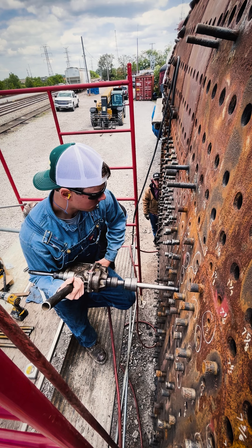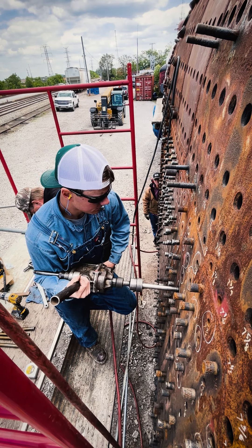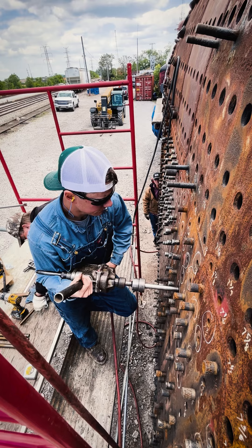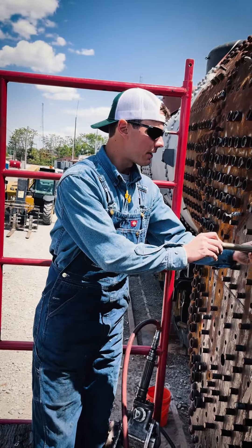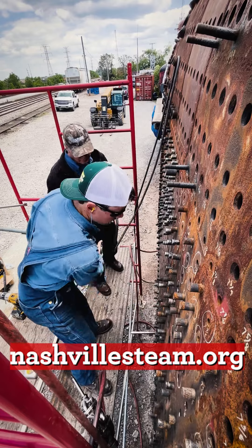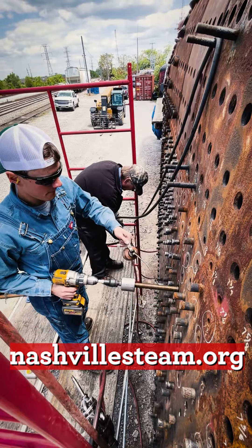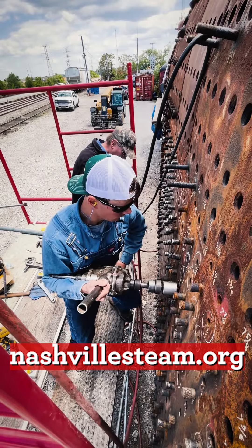The tap will be passed all the way through, then passed back out the bottom. We will clean and inspect the hole, and then we will be ready to install our radial stay bolt — it just threads in like a normal bolt. We will then take an air hammer and drive over the outside and the inside, swelling the bolt inside of the hole and permanently affixing it to the boiler, bedding it to the plate.